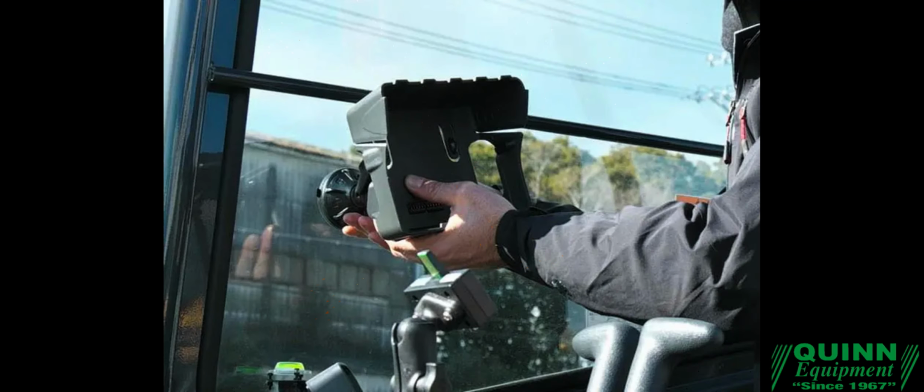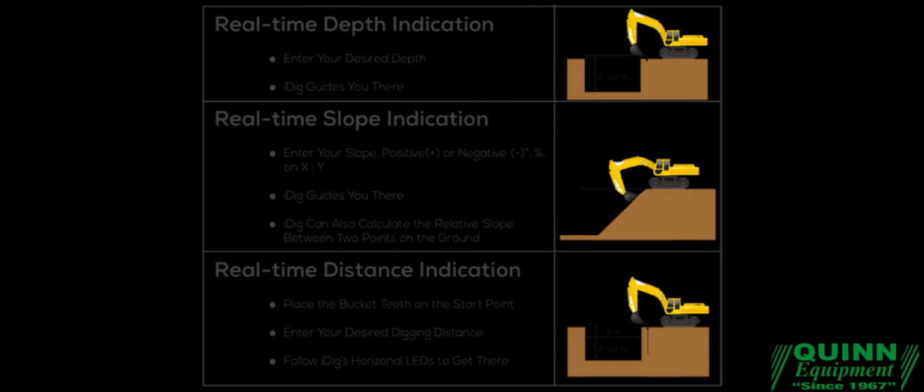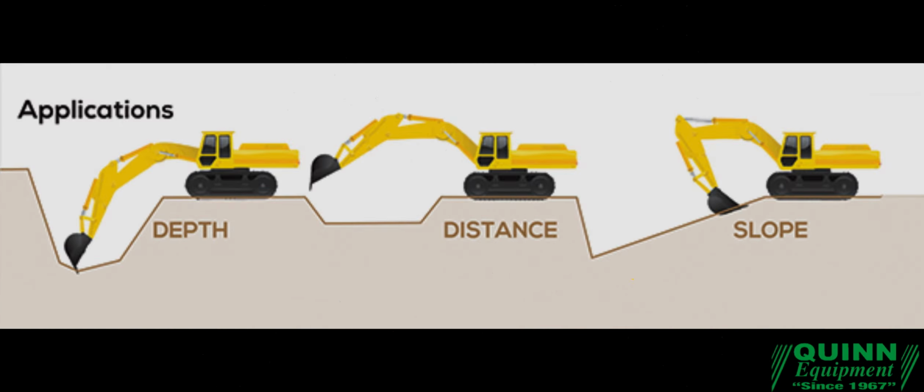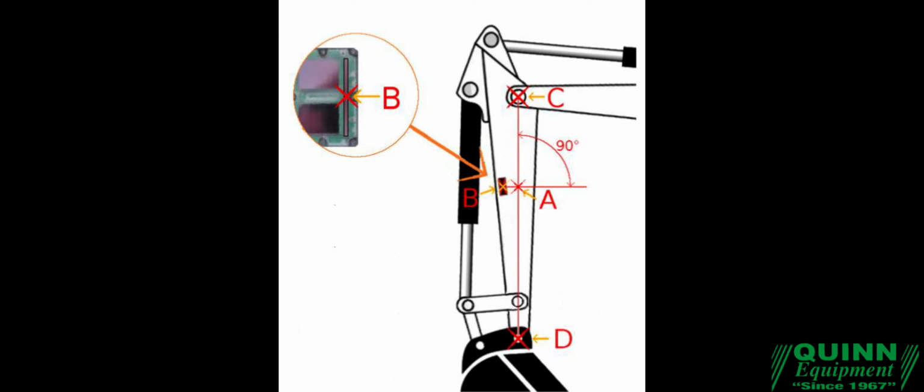Machine checks before you start. Is the excavator in good working order? Pins and bushings are well greased? A sloppy machine equals a potentially sloppy calibration and an inaccurate system. No hydraulic problems? Does the boom stay raised and doesn't drop when left in a high position? If so, you'll not be able to calibrate the boom and dipper sensors correctly, and the system will not be accurate.